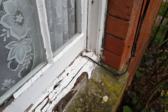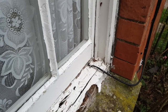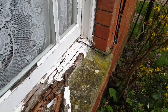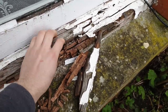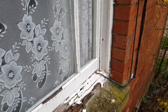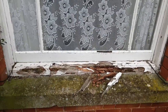I've got a special draft strip that fits in the edge of the sash, so you don't see any draft strips or brushes in the frames or in the beads. I'll come back and remove the old sashes, refurbish the frames, and fit the new sashes. We'll also need to add extra weight to the sash cords because with double glazing they're only weighted for a single pane. The original glass is probably only 3mm thick, and we'll be replacing it with 4mm thick double-pane glazing, so there'll be quite a lot of added weight.